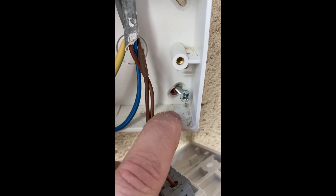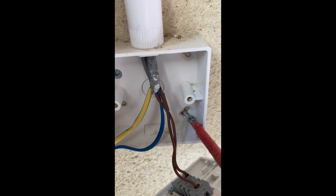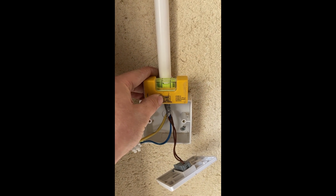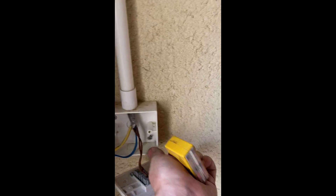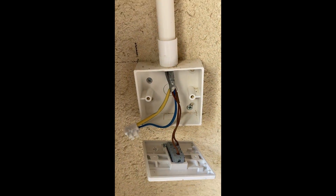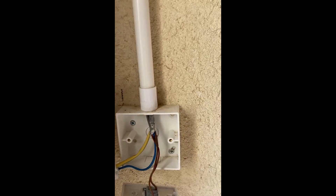I put the screw in between the plug and the wall, and now it lifts all the way up without needing to redraw the hole. Tighten it up and it's really tight — as tight as it was before, actually tighter. All I had to do was take the screw out of the centre of the plug and put it between the plug and the wall. Really they shouldn't have used opposite screws — they should have used four fixings — because when you screw those two in you actually twist the box and pull the corners in, taking it out of square.